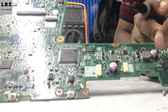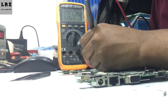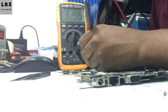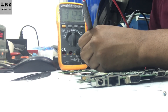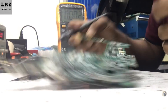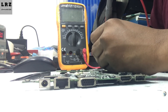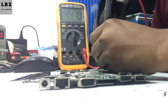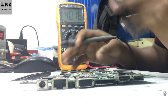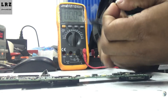Okay, as you can see this capacitor is showing a value of 312.3 — that's normal. Now I'll check this other capacitor. Okay, as you can see this capacitor is showing values of 44457.3, then 445.2, then 447.0. So this is not normal.